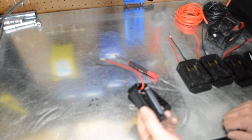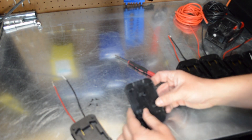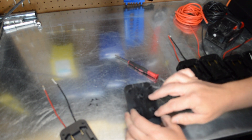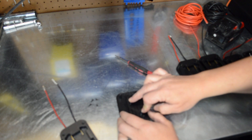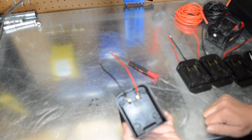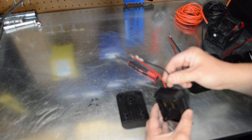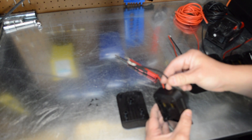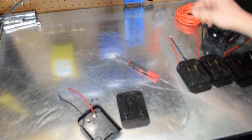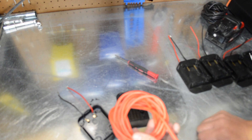These adapters are pretty cool — you can disassemble them, which gives you some mounting options. It even looks like it was potentially made to mount with three screws to whatever you wanted. You'll also notice the leads on there. It comes with 12-gauge wire, which is good if we were always going to use four batteries, but since there may be occasions we only use two, we technically need 10-gauge wire. So we'll go ahead and solder that all up.